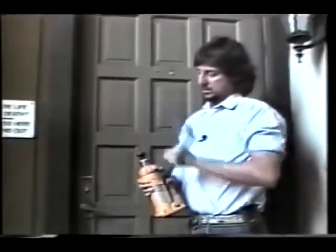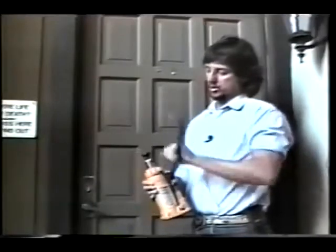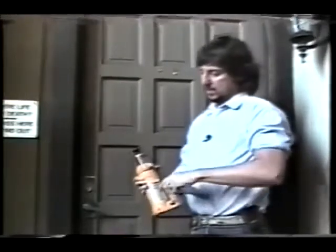One of the ways to do that, a number of years ago, people came up with the idea of taking a car jack, usually a hydraulic jack, for instance. You can tell that this exerts quite a bit of pressure to lift up an American car. You can take the jack, put it in between the jams. It's theoretically possible to move this massive wooden jam with enough pressure over far enough to let the latch, even in this case an inch and a half deadbolt, come out of the door.